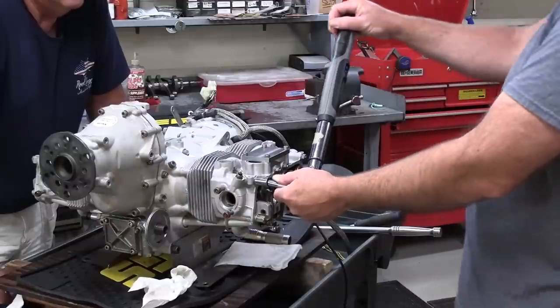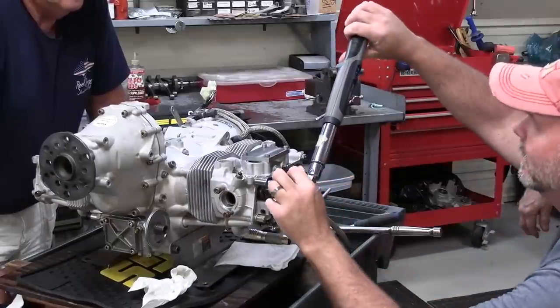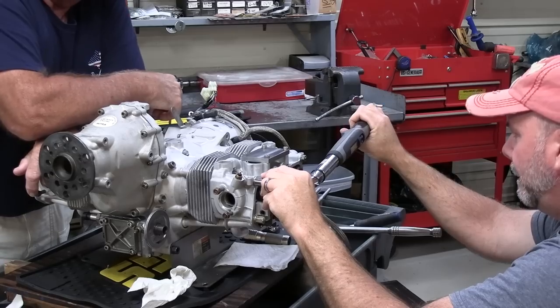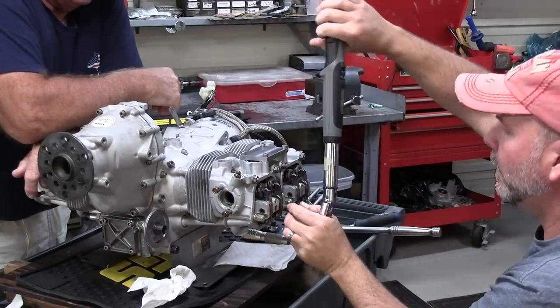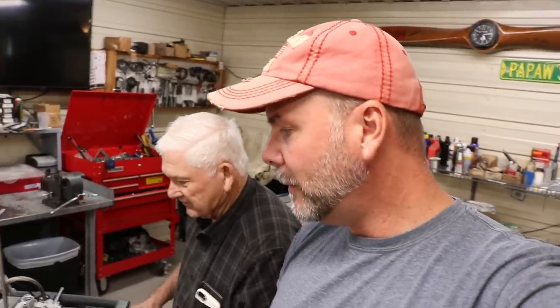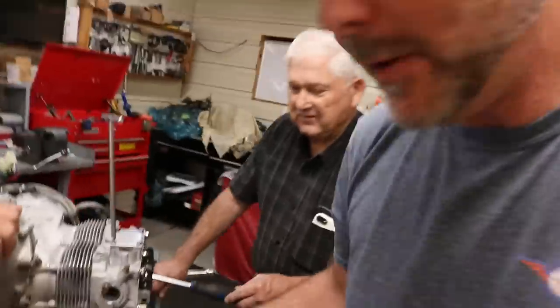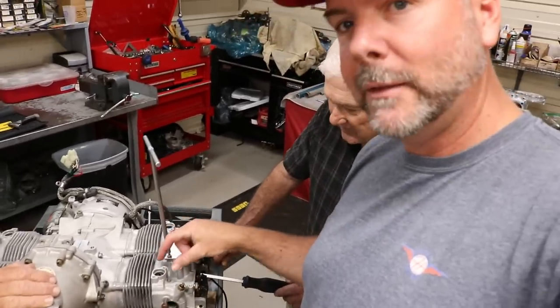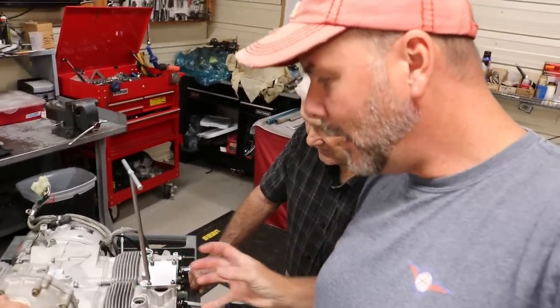This is supposed to beat — it'll vibrate and beat, and that's pretty tight now. You'll have to get on it. So we've got the heads on, just started. One of the key tips and tricks is the O-rings you install on the pushrod tubes — you want to go past the fins so you don't scratch them up and put a slice into them. Then you can put your O-rings on. Pull the head off just the corner, then bring up the cylinders to the heads first, because that's the most important part to mount — is those two. Then draw it in together.